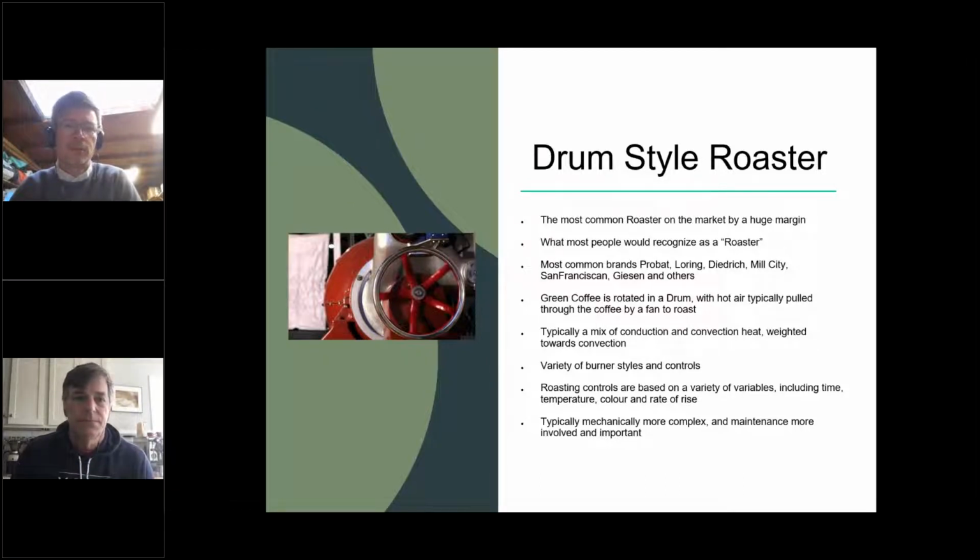The temperature application is digitally controlled. The entire recirculation system itself has a water collection system because it doesn't have an exhaust to the outside, right? So there's enough in there, and it carries 11 kilowatts of power on board, right? Natural gas is nothing to laugh at either. An air bomb in your roastery is not on anybody's agenda. But for the same reasons that we would not really want a barista to crack open a 3 group, just because of the power on board and the concern for human safety, we really do prefer to have technicians repair it. The good news is, well, the first piece of good news, we have a nice warranty.